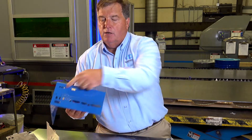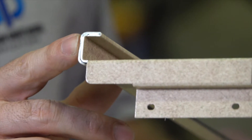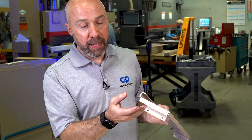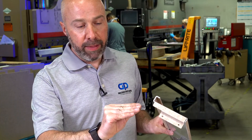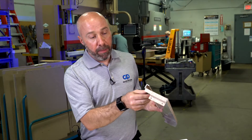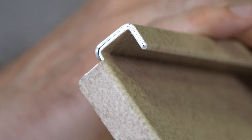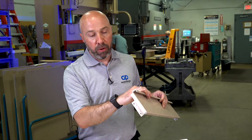The laser also gives you the ability to cut specific cutouts. This is an example of a vinyl clad aluminum part that was formed with what's called a dutch bend, where this part needed a strong handle. To process a dutch bend, we start with a hem bend — just folding the metal over like the hem on the bottom of a shirt. Then the hemmed area was bent twice, giving us two material thicknesses to form the handle of this drawer front.